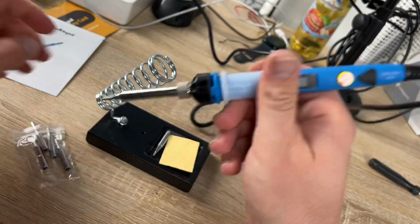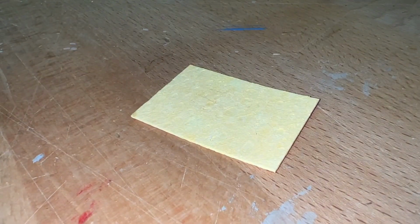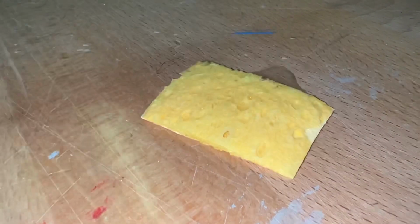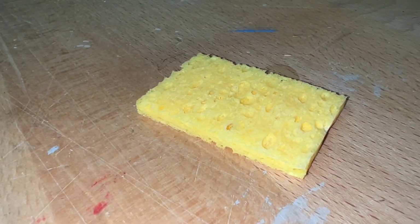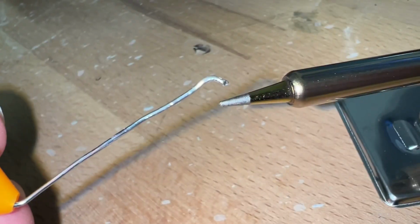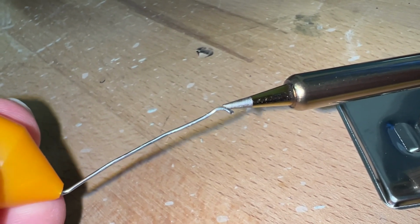Be sure that we are working in a well-ventilated area, or use a fume extraction device. The fumes from the flux are toxic. If the solder we are using contains lead, we wash our hands after we finish the soldering job.